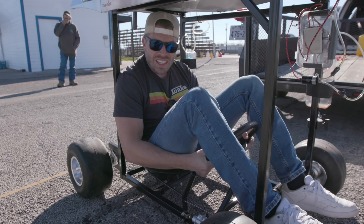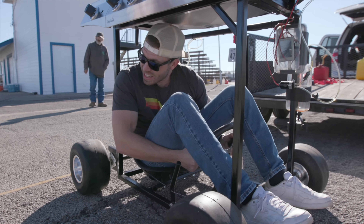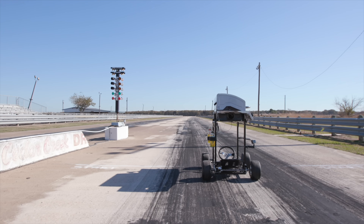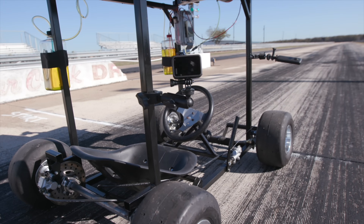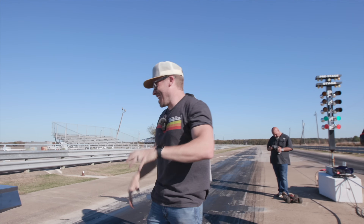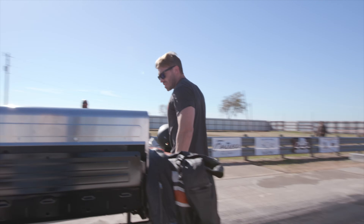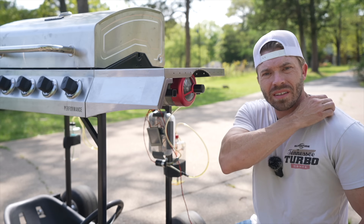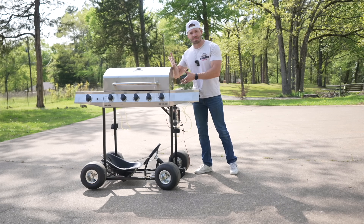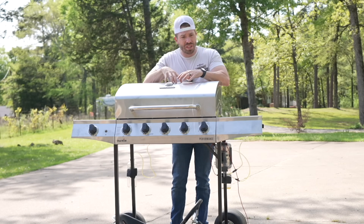Dude, it's so sick. It does not encourage good posture, and you have to steer under your knees. Surprisingly and embarrassingly, we somehow got to this point and I still haven't fully test-driven the grill yet — I have very poor time management. There are a lot of question marks and unknowns, so I'm starting to get really anxious. I've driven maybe 50 to 100 feet. So first we're lining up for a shakedown run that probably should have happened a month ago. I haven't tested the brakes. It has a short wheelbase — is that going to make it unstable? Is that going to make the steering feel twitchy? And let's ignore the fact that there's a jet engine a couple inches from my face doing 100,000 RPM. What's the air going to do to stability when it slams into this big box above my head at speed? Will this want to flip over?